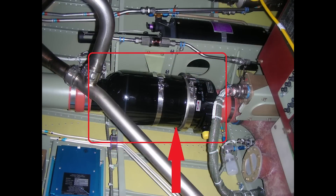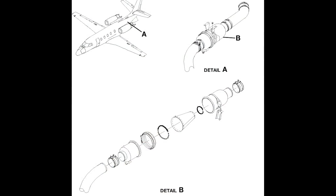The water separator is located downstream of the air cycle machine outlet. It utilizes a coalescer sock to wick the moisture out of the air stream. An ECU aspirator tube creates a suction that collects the water from the separator and sprays it across the secondary heat exchanger cooling fins to aid in the cooling function.